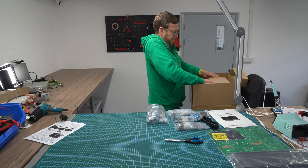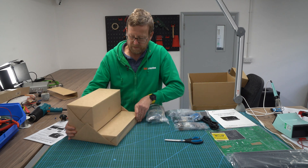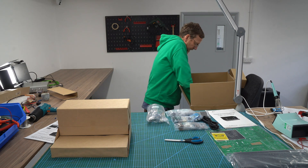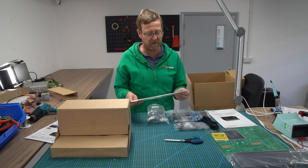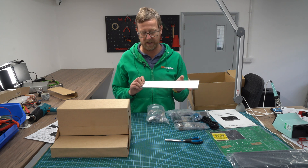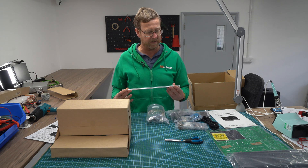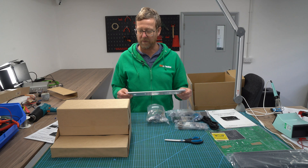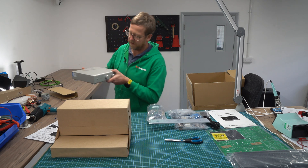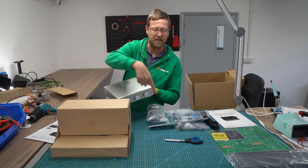There's the chassis. It's got a kind of speckle-effect finish going on — looks like a black powder coat or spray with good ventilation at the bottom. The valves sit up here. It's made of steel — I've tested it with a magnet. The front panel looks like an anodized aluminium front plate with power on/off, phono, and volume. Much better than some of the earlier bits and bobs — this is a big improvement in chassis work.